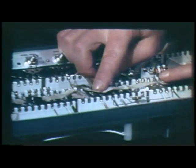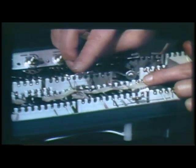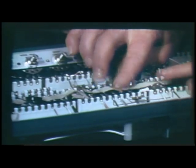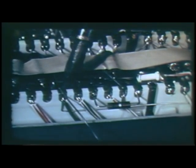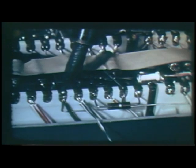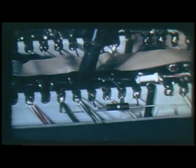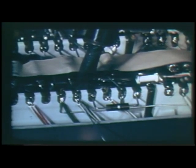In the original manufacturing of these oscilloscope chassis, the excess flux is removed by air-blasting the strips with ground-up walnut shells. In repairing the unit, the excess soldering flux may be removed with a sharp tool, a wire brush, or with solvent after the connection has cooled.